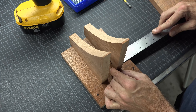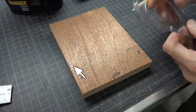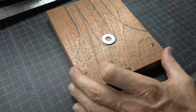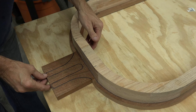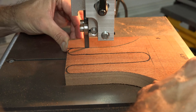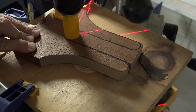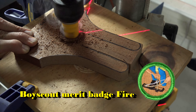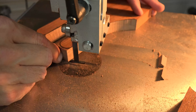Cut the scrap pieces down to a manageable size and place on the center face piece. With a ruler, evenly space your pieces — we will use these to draw out the template for the shape of the shank. Once you have the basic shape drawn out, grab a protractor or anything round to smooth out your edges. I took a sharpie to make my lines more visible so I could get a good feel if this was going to work. Then I took it to the bandsaw and cut out the outside perimeter. Hold off on cutting too far into the center until we have the inside curve drilled out. Find a hole saw that matches the circumference of the bend and press it out. Once you have your center pressed out, then you can cut the rest of the shank.